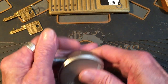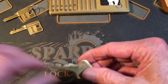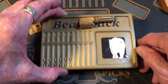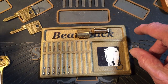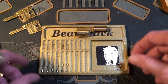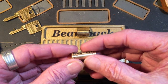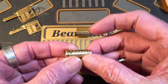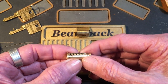Now I've got one that I'm happy with the security of, inside and outside. But let me tell you why I wasn't happy with this core. This could have been a great core like the other one, the 2508 — the square one that I did. The problem is: it's great, you've got the anti-drill and all that, but once you get one of these bump key cores, you just took away a ton of security out of this lock.